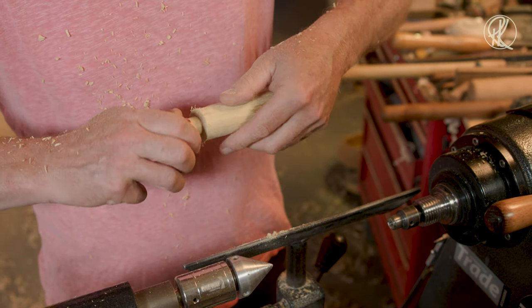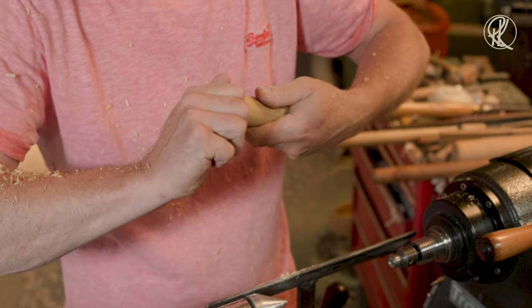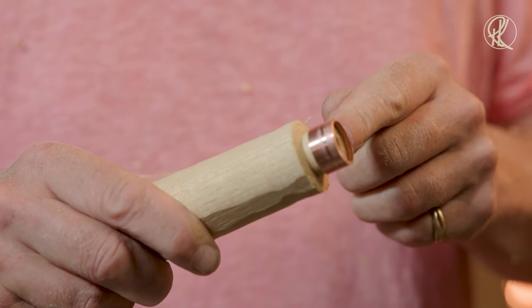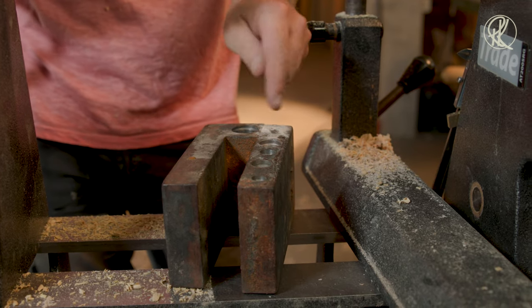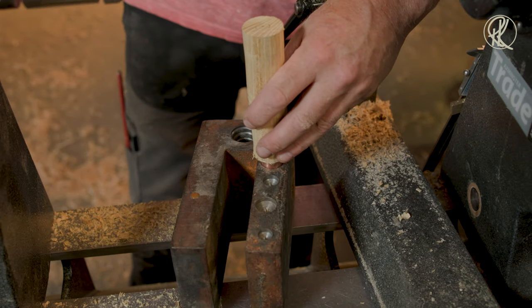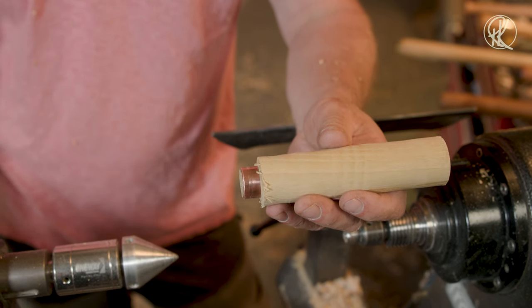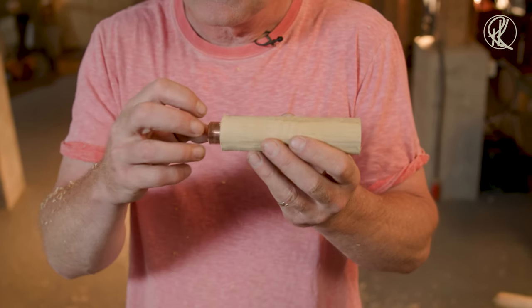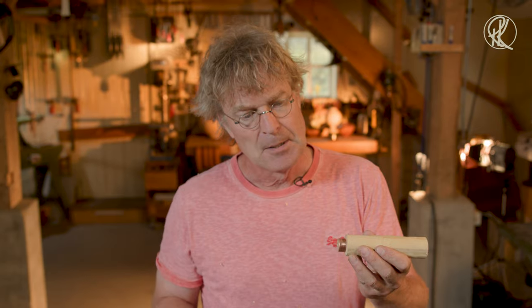Let's see if it's sliding — it's going, but not quite smooth. That's good. The last piece I do with the hammer. This is cast iron that I've drilled a few holes in — for 22 millimeters, for example. It fits in here and if I slam it, it's on there and now it is very tight. Always remember: first fit this ring, then your tool in it, because the ring is meant to keep the wood together. If the ring isn't there and you hit your tool in, the wood will certainly split.